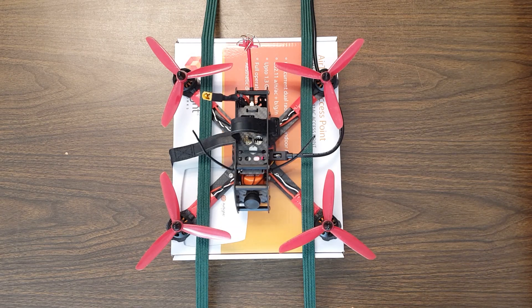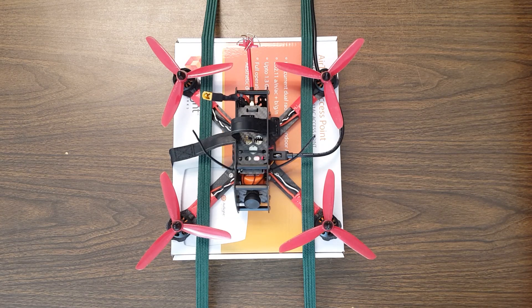If you had a power failure, you should hear one or all of the ESCs give their startup tones. That probably will not be audible to you, but if you review the high-def footage it may be audible — which is one of the reasons why having a high-def camera or a microphone can be really useful from a troubleshooting perspective. If your copter tumbled out of the air, you did not have a failsafe, and you did not hear your ESCs reset, that is starting to indicate you may have an ESC or motor problem. You can go to black box and confirm that a motor went to full throttle while the copter was moving against the motor, which verifies that a motor has stopped making thrust.